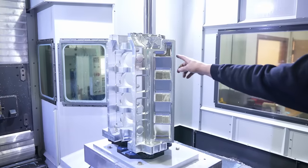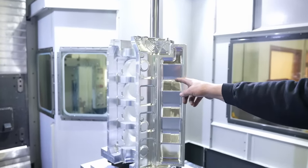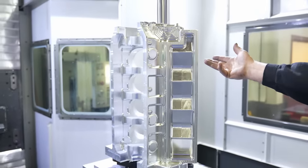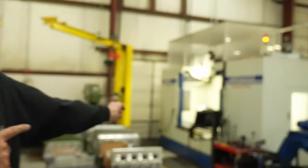So you finish up the sides, the decks are done. The bores are for what? For 50 thousandths from final size. Although they're a step bore in this, so that's pretty close. So do the sides, and I think the lifter valley. Well, everything that's up on this end where the tool can get it, and then you're gonna flip it over on the other side on the deck surfaces and do both ends. Then it goes over into that machine to get more work on it.